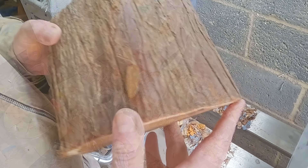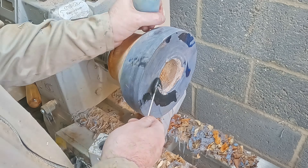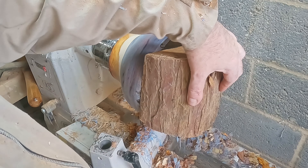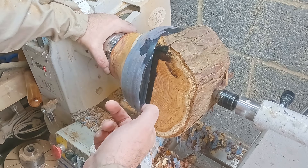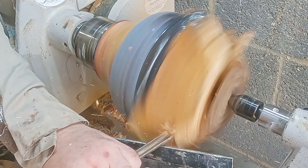For the top, I had a section of yew. I flattened the cut face on the large disc sander. This would then be bonded to the top of the resin blank with 5 minute epoxy. The rapid setting epoxy was mixed with black mica powder, then applied to the resin blank, and what was left I applied to the yew. The two pieces were then pressed together using the tailstock to pin it in place and add the necessary pressure.